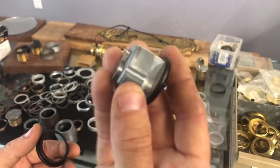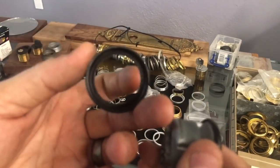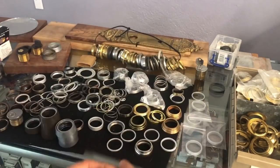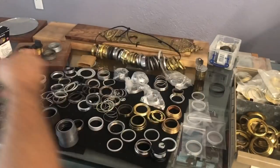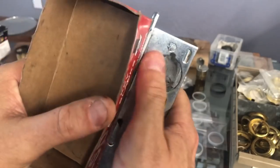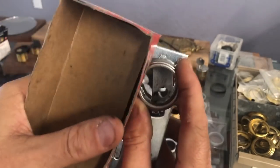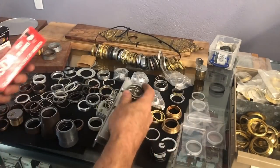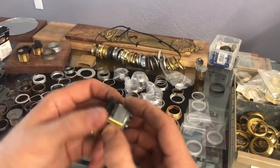The aluminum cylinders that come with narrow style doors now just don't hold up because of the material, but they do come with this little spacer or blocker ring. Holding it up to the ILCO version, we can see it's a lot bigger. Sometimes on doors where your door comes up against a stop and you have an inch and an eighth backset, you don't have a whole lot of room to fit some of these bigger adjustable collar styles. I've seen them filed down or cut to make them work and that's just not a great idea. Sometimes you're left with no choice but to use the smaller straight ones, and I typically use those because again it's not a security issue — it's more about filling the gap to make it look good up against the door.